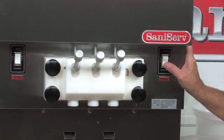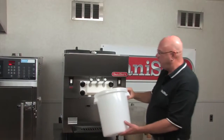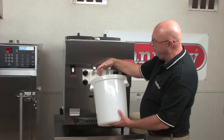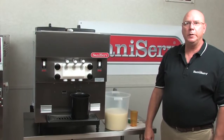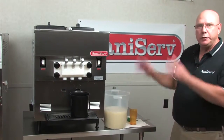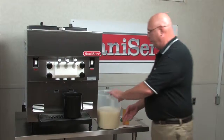Okay, the minute's up. Next, I'm going to drain all of the sanitizer out I can get. I'm going to pull a little bit first through the center plunger to be sure that it's sanitized. Okay, I've drained all the sanitizer I can get out of this barrel. I'm only showing you how to do this all in one barrel. You'll need to do it on both basically simultaneously.